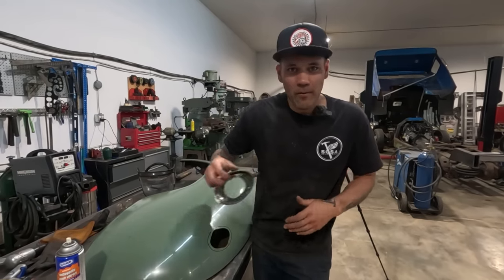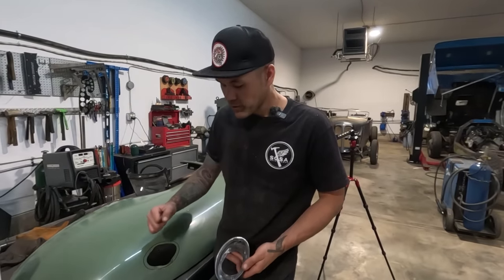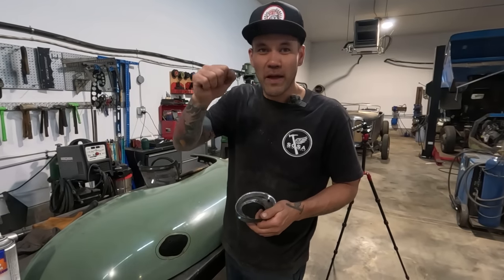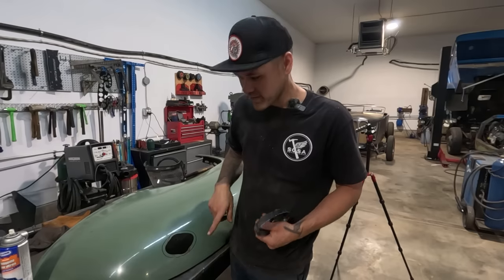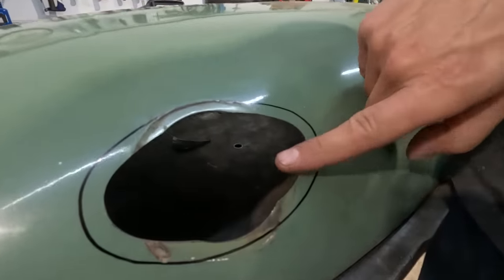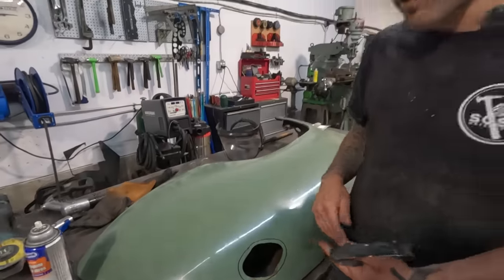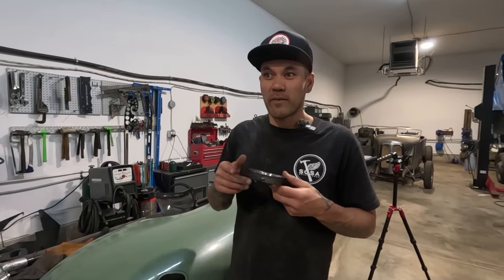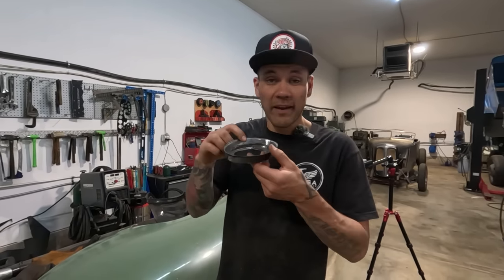What the plan is now is to build this tool that I've been talking about to turn this flange down. Now, as we turn this flange down, the way these little tools work is that because you're doing so many small increments all the way around, it slowly stretches it as it goes. But when we get into tight areas, such as this tighter corner here, for this flange to turn all the way down, it's going to have to stretch quite a bit. And because Elio asked how we are gonna get it to stretch that much, I was thinking ahead a little bit and knowing that we're gonna have to drill holes in this flange for us to spot weld back to this piece.